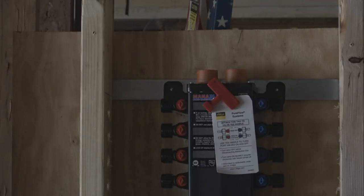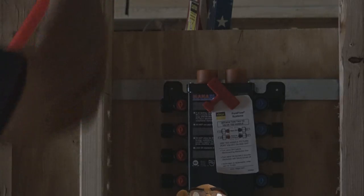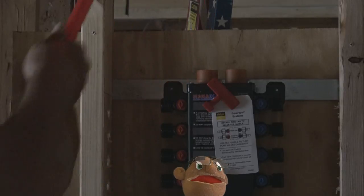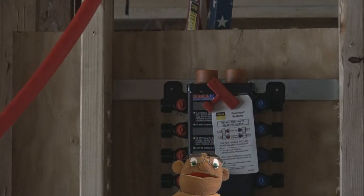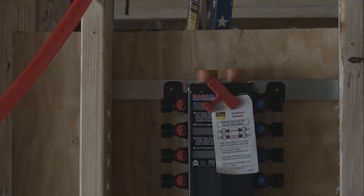Yeah, we're back to the manifold, and all of the work you just saw me do is in preparation to run the main cold water line over to here. But first, we're using red, and red is always an indication of hot. This red is going to go from the manifold block over to where the hot water heater is going to be,